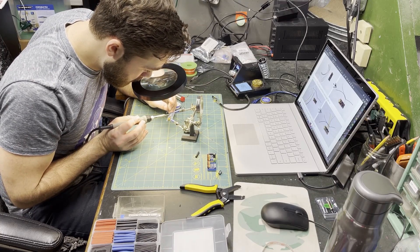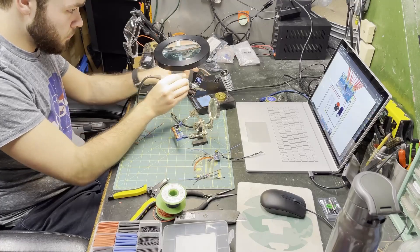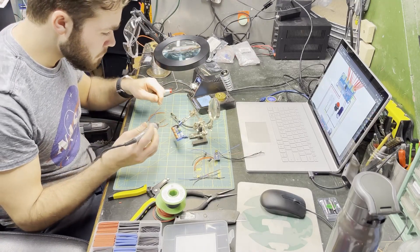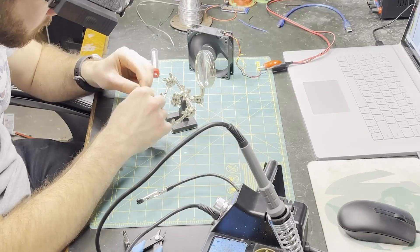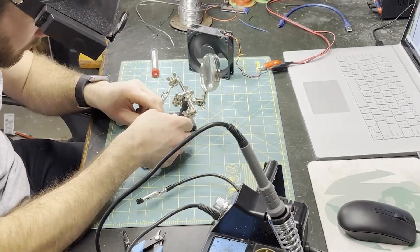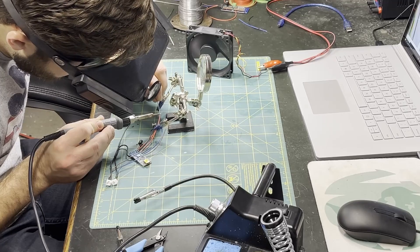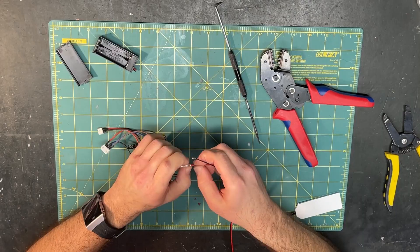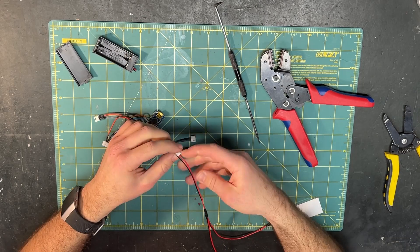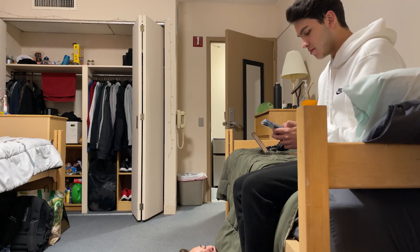I could have used DuPont pins that came with the board, but I decided to solder the wires directly to the through holes to save some vertical space. I used mostly 22 gauge wire, but anything from 26 to 18 gauge should be fine. After a serious learning curve in terminating wires with JST and DuPont connectors, I had all the wires terminated. When soldering JST male connectors, pre-solder the wire and minimize heat to the connector because the plastic can melt very easily. For the male USBs that plug into the battery pack, I just used plugs from some old chargers I had lying around.